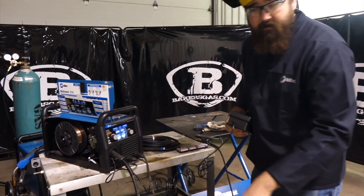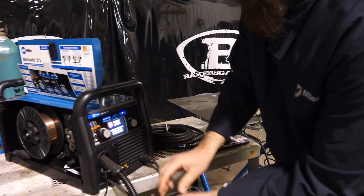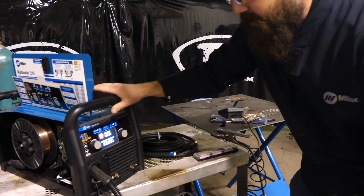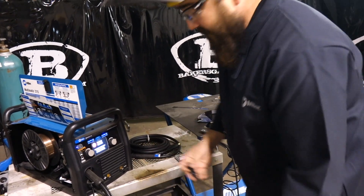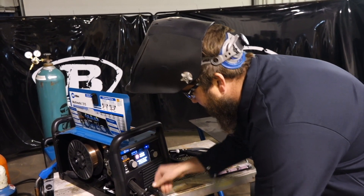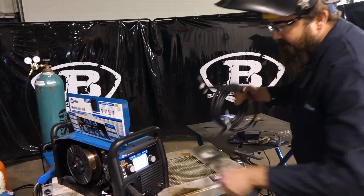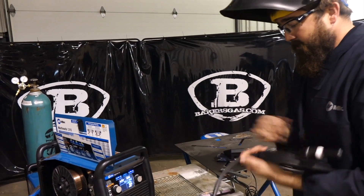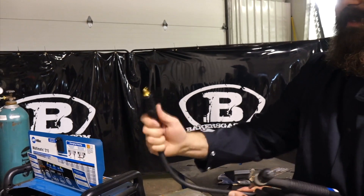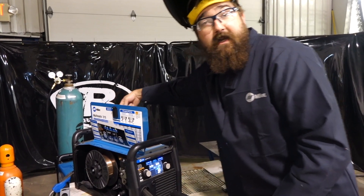Notice I left the MIG gun hooked up — we can leave the MIG gun hooked up. It says cable error, we know that. On TIG welding, you run DC electrode negative. This machine does not do AC, only DC. DC electrode negative means our TIG torch is going to be hooked to the negative terminal, and we're going to hook our ground to the positive terminal. It's telling us to use 100% argon. Plug that into the negative terminal. Notice on the back there is a gas port — this has a through-the-TIG-torch, through the DIN connection, gas port. There is no external gas hookup. You just hook up on the back of the machine in the TIG port for the argon gas. You're good to go.